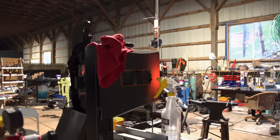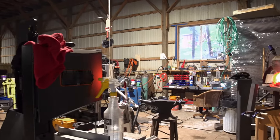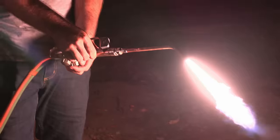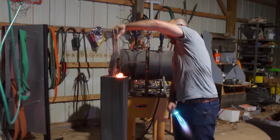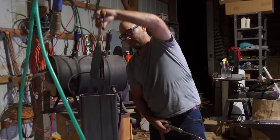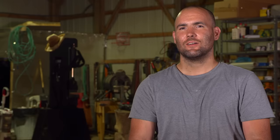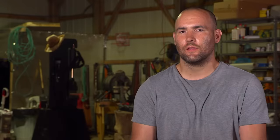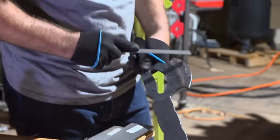Day two, I'm a little tired this morning, but I feel great, ready to get this show on the road. I decide that I'm gonna go with a torch heat treatment because the handle doesn't need to be hard — I just need the blades hard and the knuckle blade hard. I did one, and I'm scared I'm gonna crack it in half, because right after the quench it is brittle. Any little shock or hit could cause catastrophic cracking. Luckily, I don't see any cracks, so I think the quench went well.